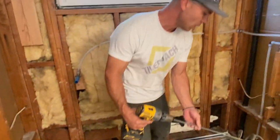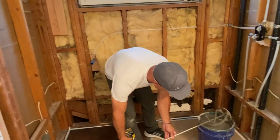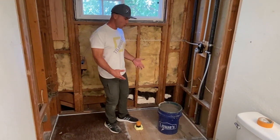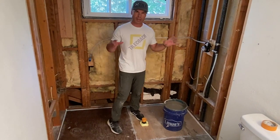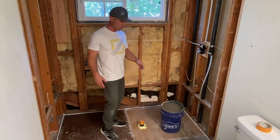So anything bigger, the caulking won't seal up. I put the foam, and so yeah, let's get it mixed up. Okay, so it says to mix for 2 or 3 minutes. That's about what I did here. Okay, so I'm gonna start just pouring about the quantity that I know is needed. You know, I have some marks. I got 5/16 here, I have 0 here. So I'm gonna just pour it out where I feel like it's gonna need it the most and then start working it.